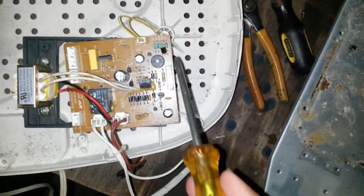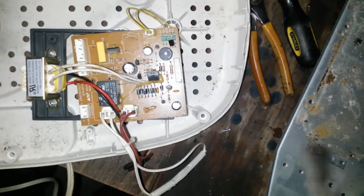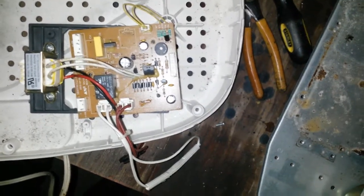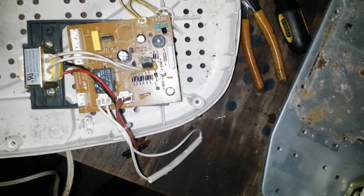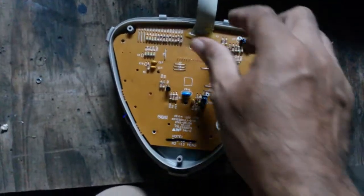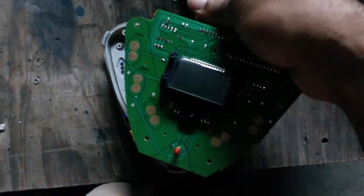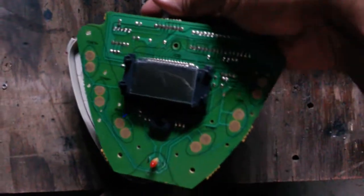Not sure why they're doing that many diodes, but it has to be 120V rectification and 10V rectification. A little beeper, couple of resistors, a few passives — no microcontroller here. So that means the microcontroller is on the front board, which is a different approach, but with the ribbon connector they could get all that information across to the micro.